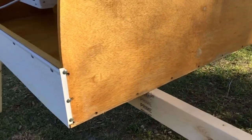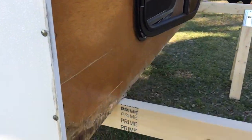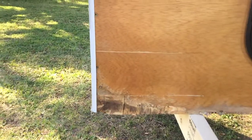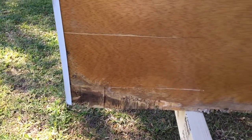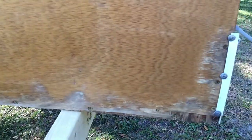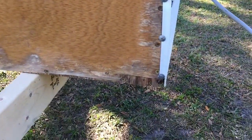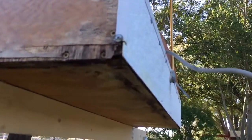Let me show you some of the damage that's happened to it along the sides and the bottom. We're going to undercoat it and fix some of this damage. This one's a lot more damaged on this side — the plywood has disintegrated there. So we're going to try to repair some of this and get it undercoated so that it doesn't wick up so much moisture.